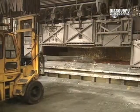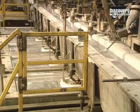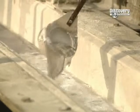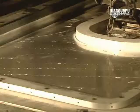The crucibles filled with their molten load are transported to the casting house. Their contents are poured into holding furnaces, which have a capacity of 60 tons. Finally, casting begins. The aluminium is either vertically cast, producing ingots or sheets, or directly cast into molds for finishing later.